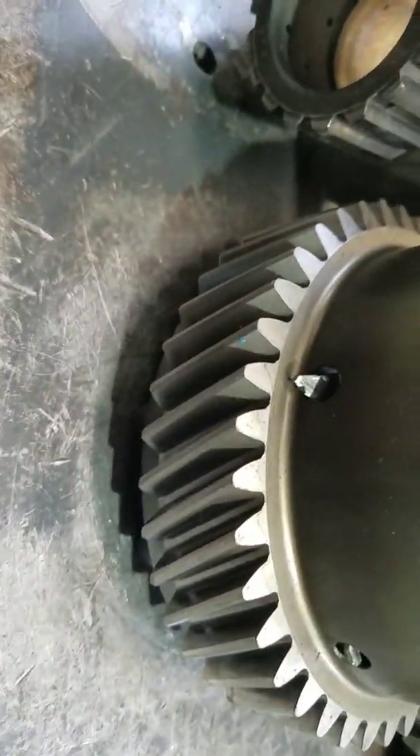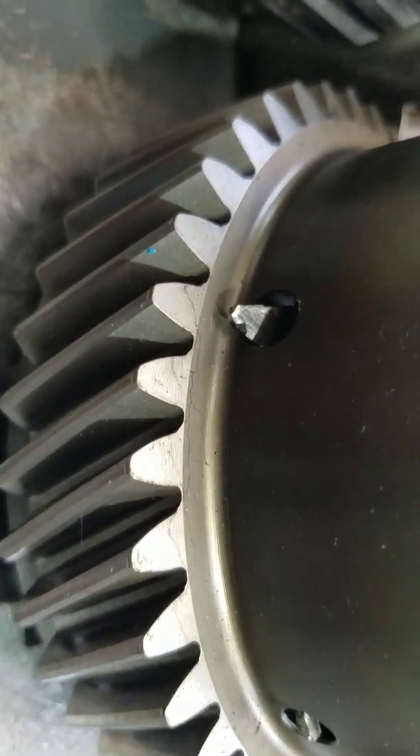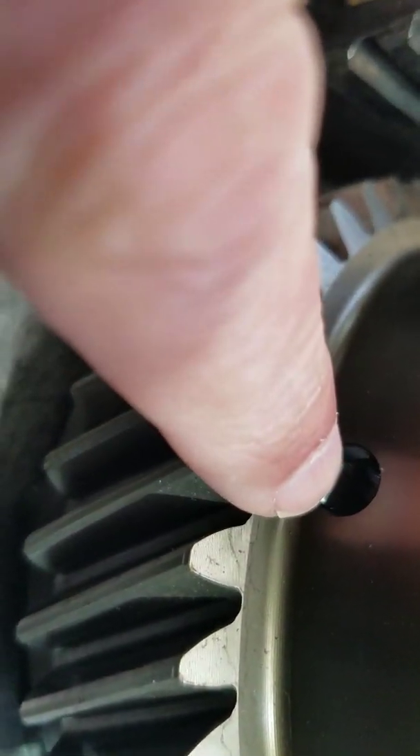And of course you get the blue, the dark color of the overheating, and you can actually see parts of the clutch plates that broke up that are now trying to get out through the relief holes here and here.